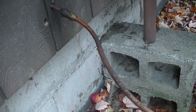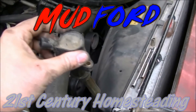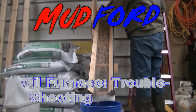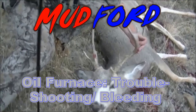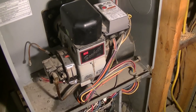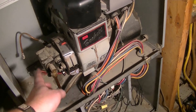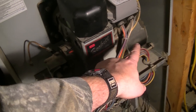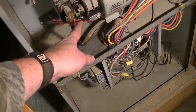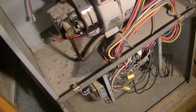So let me show you my troubleshooting. Here we are in the basement. I've pulled the covers off the furnace. Here is the line where it comes in, and there's a pump here. The motor that runs the fan also runs this pump, and there is a bleeder screw right there. I bled it a little bit and thought I had it, and I tried starting it, and it would just kick off.